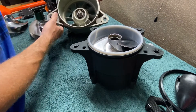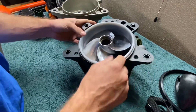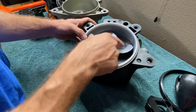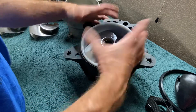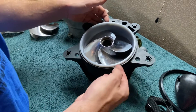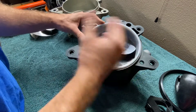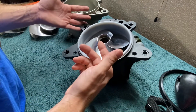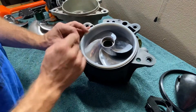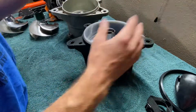The main thing I noticed was trying to install a new wear ring. I had to take out the factory one that SBT had put in — it was a hard plastic. I wasn't able to just throw the pump in the freezer and slide it out like I could with the factory one. The reason was that on the backside of the wear ring it's very smooth, so it was essentially forming a vacuum. I had to cut it out — used a plastic welding tool and just melted through it, one little section, then put a plastic pry bar down into it, wedged it out, released the tension, and it slid right out.